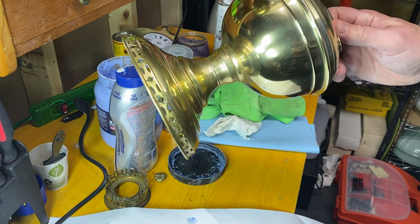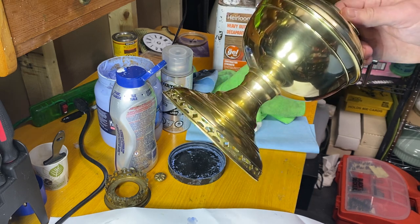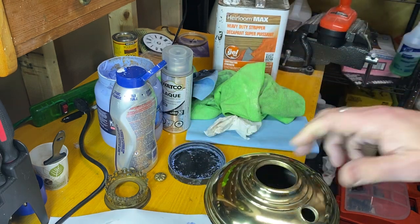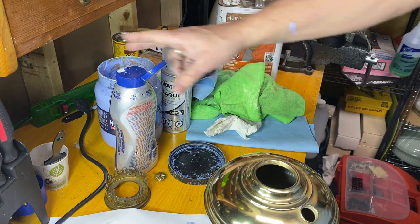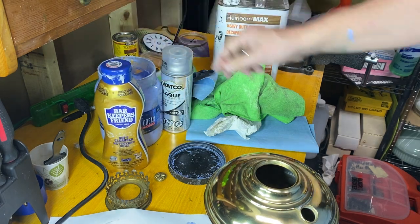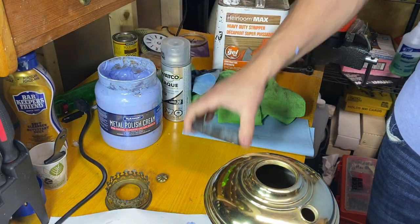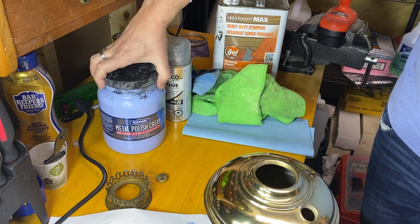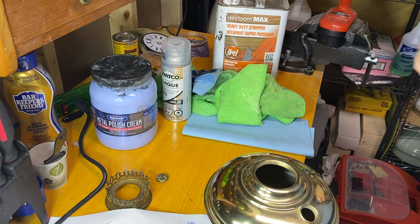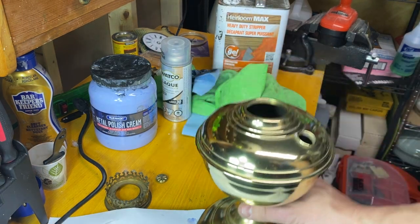You can see the type of polish you get in a very short period of time. This lamp was in very good shape, but the more oxidized it is, the more time it takes. The things that really cut down on the steps are making sure it's stripped, then going for Barkeeper's Friend - they make other products but this one is really the best - and then Blue Magic, which is the best polish I've used over the last 30 years. Definitely not sponsored by those guys but I really like their products. Anyway, that's my video today - hope you like how it turned out, have yourselves a great day.